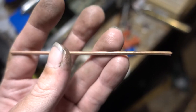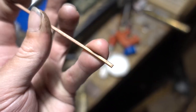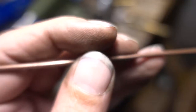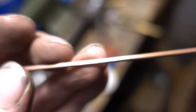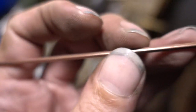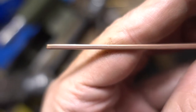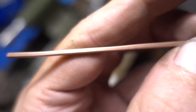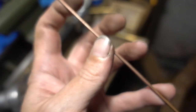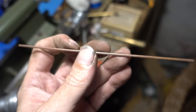So I rolled that piece out a little more, and this is now the annealed state, and it's quite tough and springy even in the annealed form. And yeah, so quite interesting properties. So a little further with that, seems to work quite nice. It's springy, and I mean, this was a crappy piece of metal with a lot of inclusions in there from directly there in the top of the molten metal where it solidified with all the crap in there. So seems to work for springs.